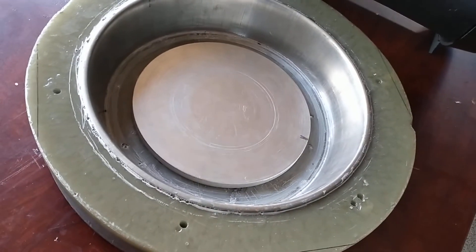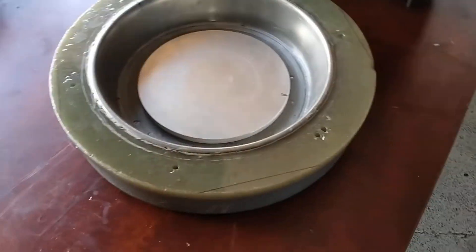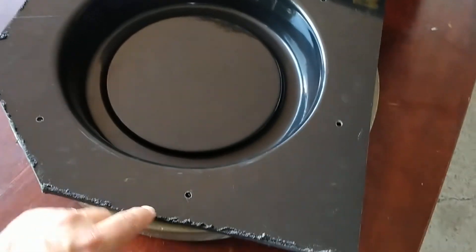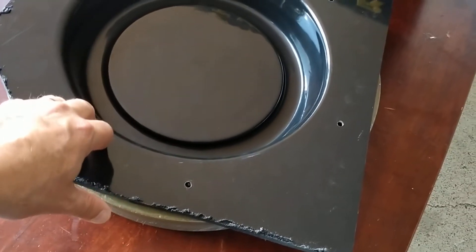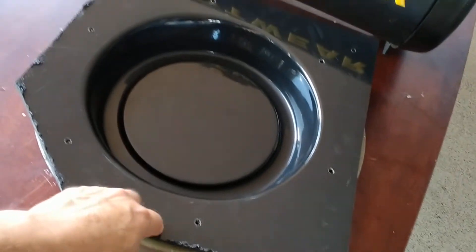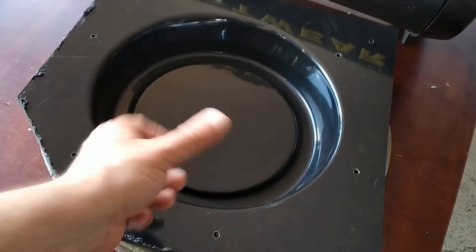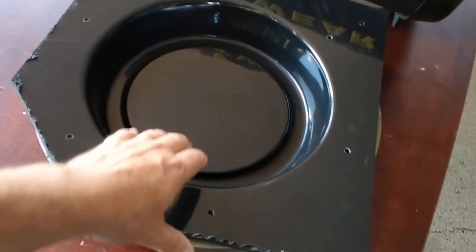The plastic sits on top. Here's one of the parts I've pulled from this tool — as you can see, it sits nicely on there. Heat this plastic up — there's a rubber seal that goes in under here and then it's all screwed in, nice and tight. Heated to about 180 degrees — this is 4.5 mil plastic, by the way. 180 degrees and then pull it down. I'm using a vacuum pump and a vacuum cleaner. The vacuum cleaner provides surge and then I switch over to the vacuum pump, which allows me to take it to the full 30 inches of mercury.